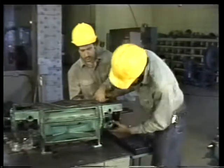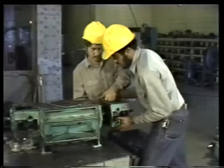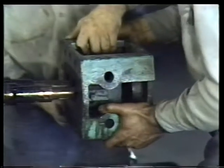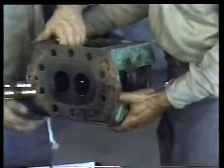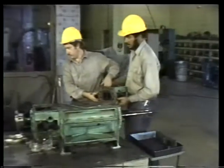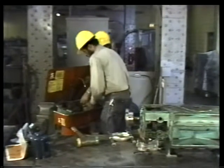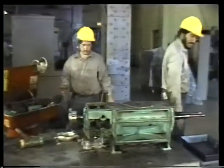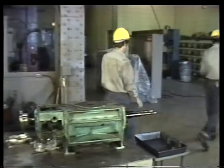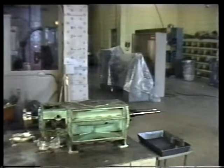As you slide the bracket away from the casing, avoid bumping the studs or the mechanical seals located on the shafts. It's a good idea to take the bearing bracket directly to the cleaning tray, since you'll be cleaning it later anyway. That takes care of the timing gear housing, the timing gears, and the outboard bearing bracket. Before going on with the disassembly procedure, review the material we've covered so far.